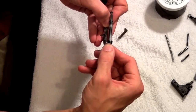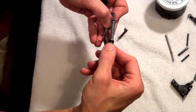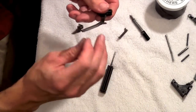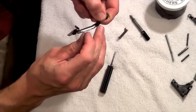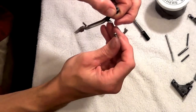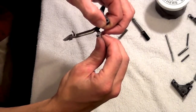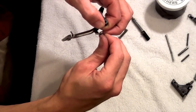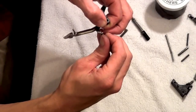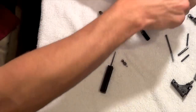If they're dirty or rough metal surfaces, they're going to grind against each other. The last two surfaces are the top of the trigger bar and the firing pin safety. When the trigger is pulled, it goes back, pushes the firing pin safety up, allows the striker to go forward and strike the round, and goes back down. So you have these surfaces continually rubbing — those are the parts we're going to polish.